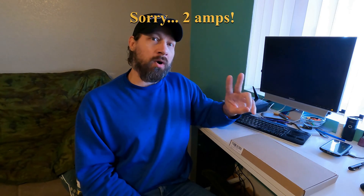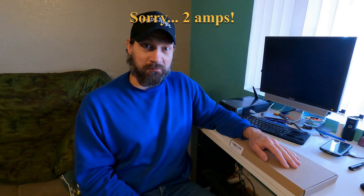This solar panel has quite a bit bigger numbers than that one. This is 20 watts of power, also 5 volts, but it puts out a 2 amp charging current. The reason 2 amps is so much more important is because if you're charging a device using a 1 amp current and you charge that device in 4 hours, if you step up to 2 amps you're doubling your charging current, which reduces your charge time by half. So I could probably charge the same device using a panel like this in 2 hours.